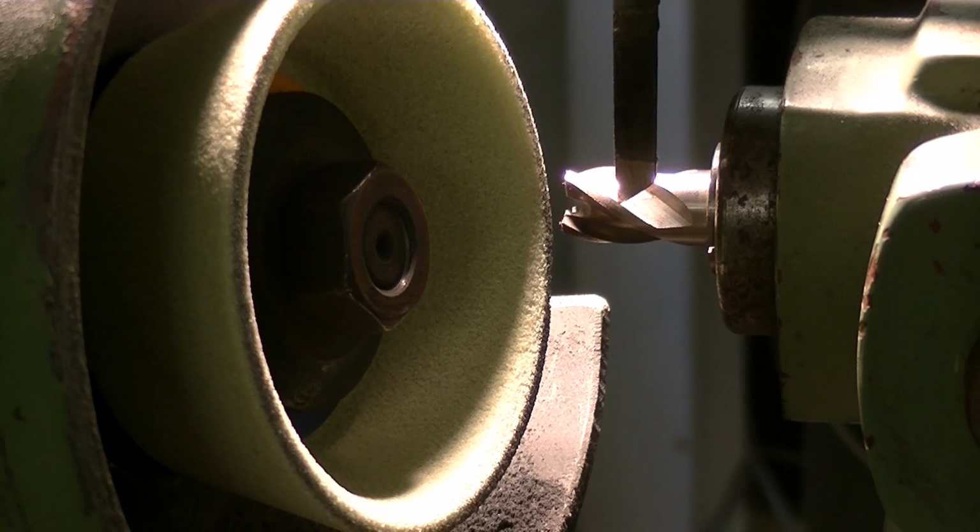I have seen Don Bailey from Suburban Tool do a demonstration on creep feed grinding where he took about 25 thou in one pass, but he was only side feeding about 2 thou per pass, and the man's an expert at it. He made it look so easy, but creep feed grinding is something that I would keep well and truly away from because it'd be too easy for me to bloody crash it.